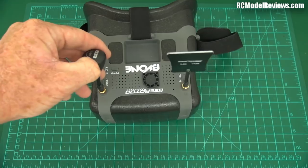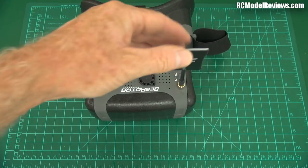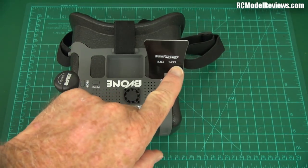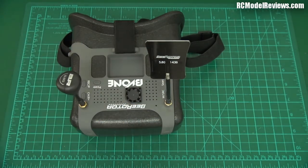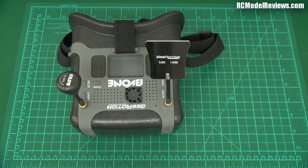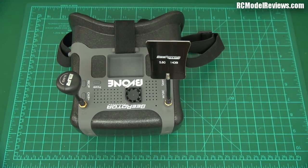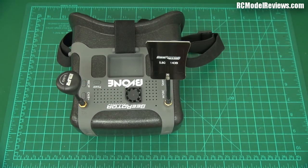It looks like it's a Pagoda — I'll crack it open in another video. It's already got a bit of a crack in it. Also a patch antenna of 14 dB — well, they claim 14 dBi. The 'i' stands for isotropic: it's 14 decibels over an isotropic radiator, which is a radiator that has no gain at all and radiates evenly in all directions, which of course is physically impossible, but it gives you a reference point. Generally speaking, patch antennas do give you gain quite often, not as much as it says on the box, but it will give you some gain.